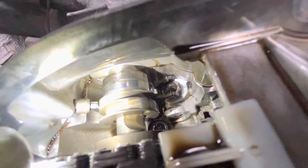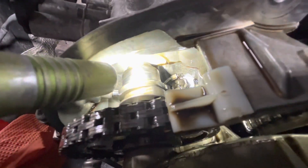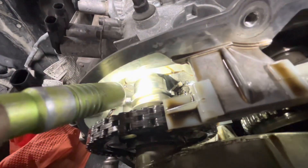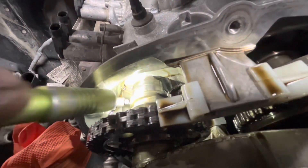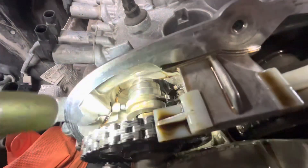The heel is smooth right there. If it were to actuate when the lobe was present, there would actually be a step, because there are two lobes next to each other. So it has to be actuated at the heel of the cam — when the peg shoots out it slides the whole thing one direction or the other.